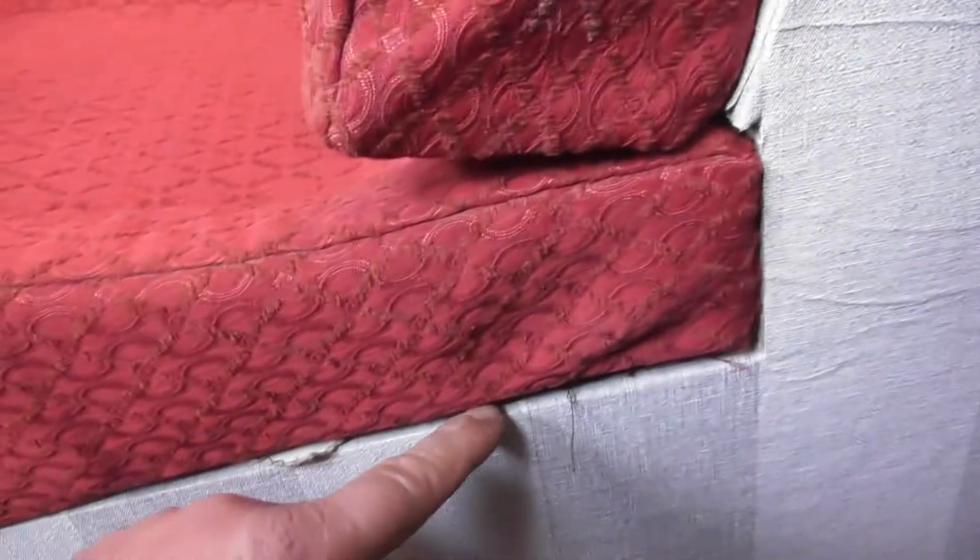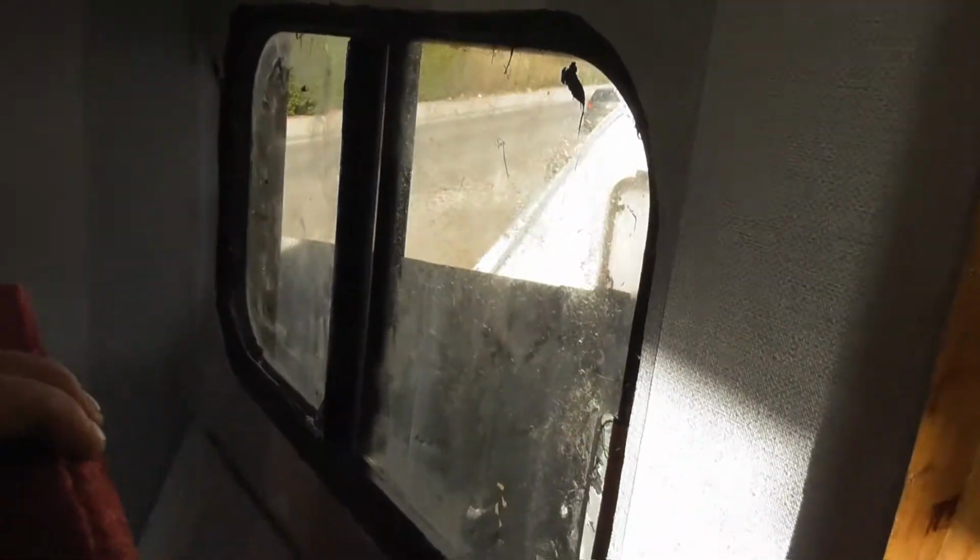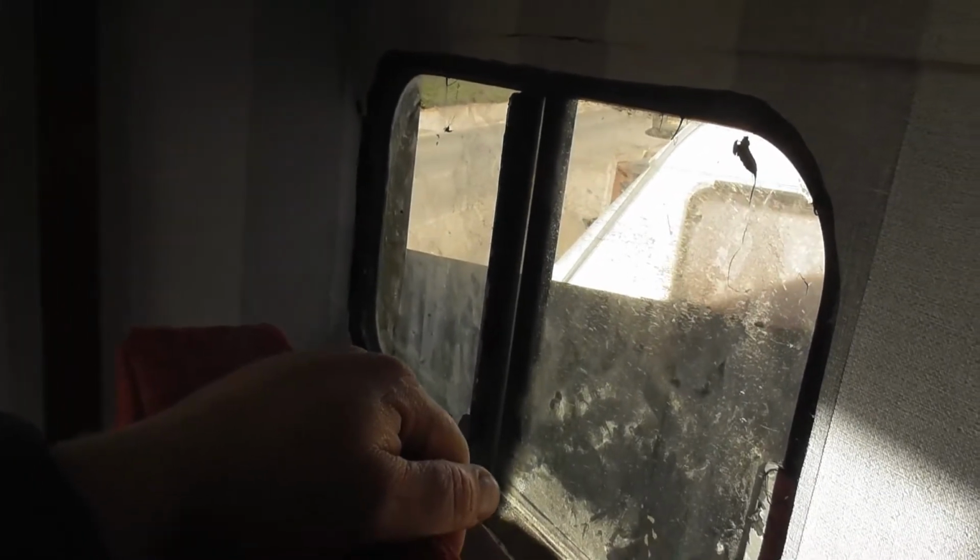But the other thing we're going to do at the backrest is we're going to get some gate hinges, and we're going to literally fold them around there, screw them to that bit there, and then hinge onto there. So when you lift it, that piece will stay attached to the base, and it will literally go up, and the whole thing will go up there like that, and then I can access the back board. There's also a piece of wood to go on the back as well to bring it away from the wall. That way we don't get any interference of the windows when we put the blinds up, and that will also allow me to make up a frame, which has been concerning me quite a bit, and we can put the headrest in place as well.